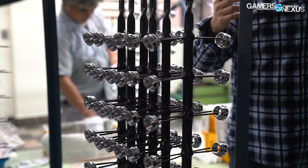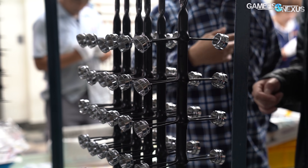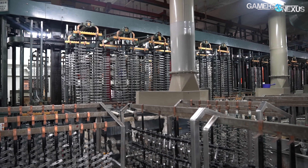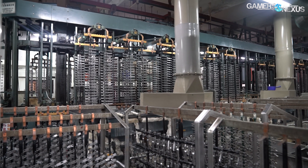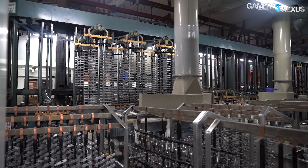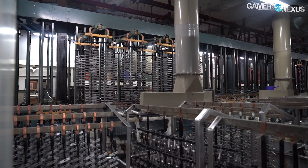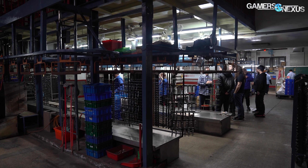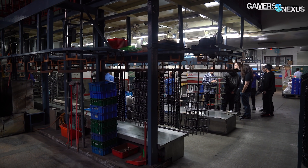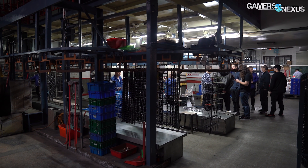This is the part of the process where the conductive metal racks come in — cleaning doesn't involve electricity. Three of the dunking bins are dedicated to actual electroplating, and these are held to a temperature between 60 and 70 degrees Celsius to raise the conductivity of the electrolyte fluid. Plating takes 20 or more minutes, and moving a rack through the entire line of cleaning, rinsing, and plating takes roughly an hour, after which the racks are removed and blown dry with an air compressor.